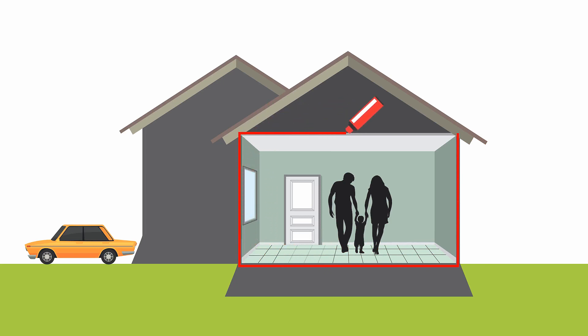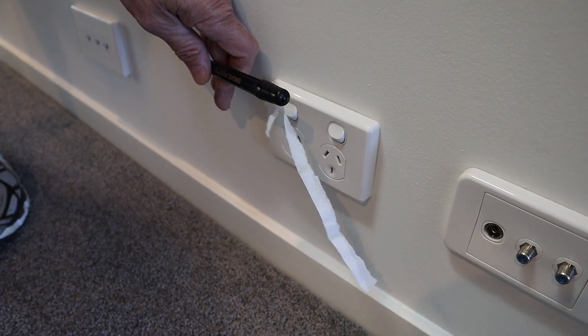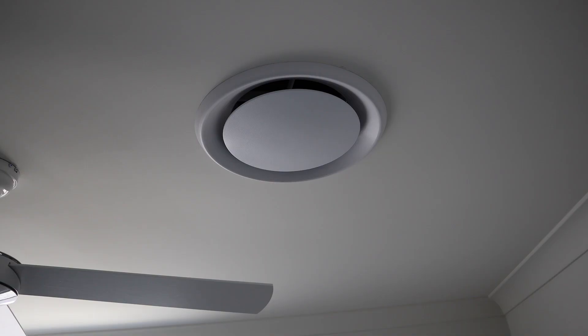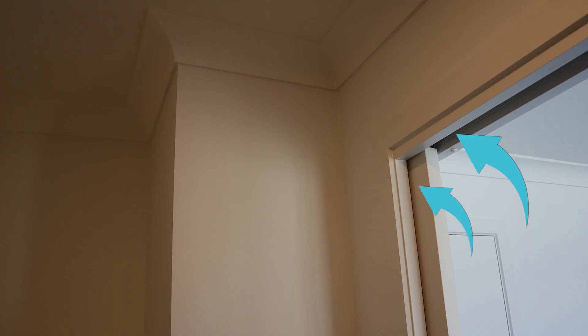Make this into a well-sealed system and provide good ventilation. Once this is done, all the other stuff like your attached garage, your porch, even your roof - those can be thought of as separate things that are attached to your box. Air sealing a slab is not a problem. The walls we've just talked about, and the ceilings - all sorts of things poke through these elements and they can have some major air leaks.